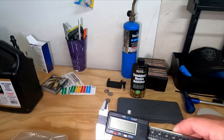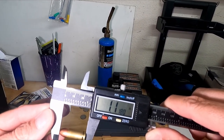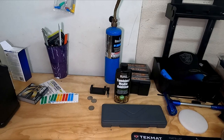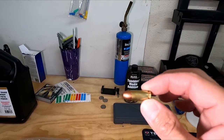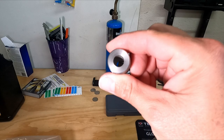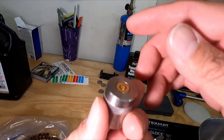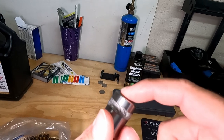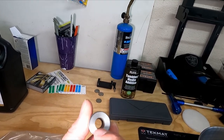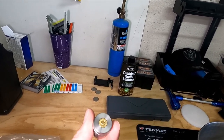I've got my first round done — not quite though. I take my digital calipers to check the overall length. I'm at 1.118 inches, which is perfect for my guns. Some people do different sizes but 1.118 chambers perfectly in my handguns, so that's what I'll continue to do. Then I grab my case gauge and drop it in — it dropped in perfect, nice and smooth.